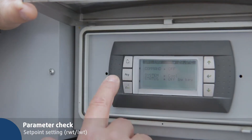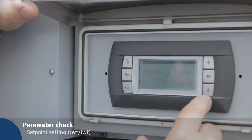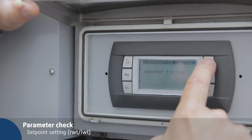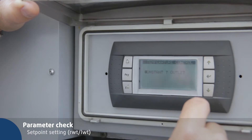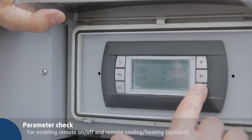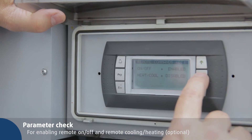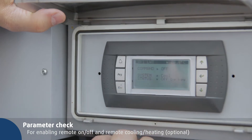Press PRG to select the operator mode, then press up to enter the main menu. Press enter once to select the service menu and again to confirm the unit application area. Press the down key to select temperature control, confirm with enter, and choose between four set point configurations. Press escape to go back, then scroll with the down key to the remote control area. Press enter and up to enable remote control. Select heating/cooling with enter and enable it with the up key, then press escape to exit.